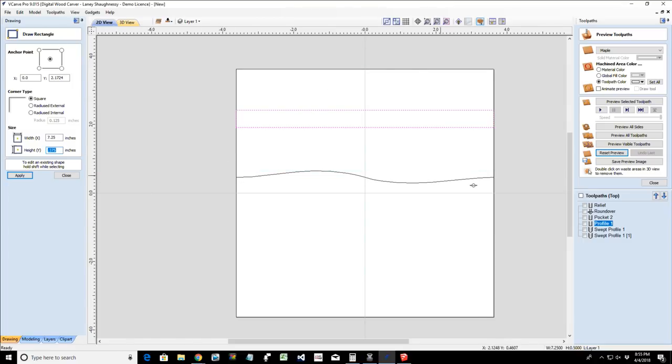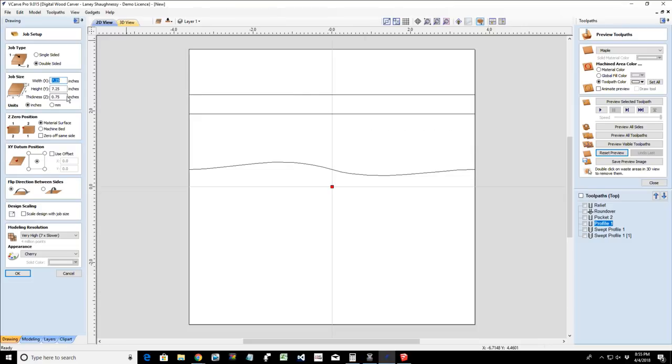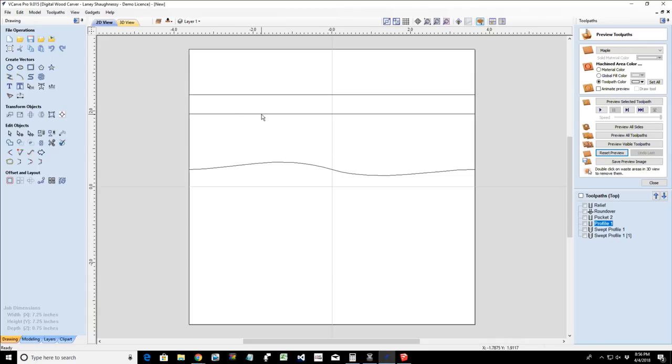The other half, and with the thickness of my veneers in the middle, whatever I come up with for that design, I'm going to have a decent size ring band of a good bit over, should I say, 3/4 of an inch. So I might want to reduce my material thickness on the job down to 1/2 inch. Because when I cut away that 1/4 of an inch material, that wave, and then I glue in my center pieces and glue the other 1/4 inch piece of material, that's going to determine the thickness of my ring band. In this case, I'm working with 3/8 of an inch.